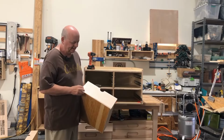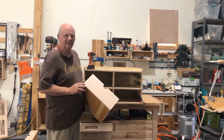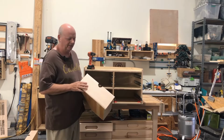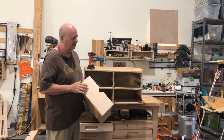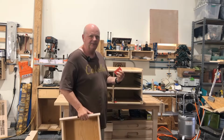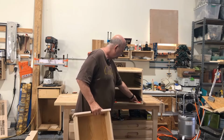So I completed sanding all the drawers, applying a slight chamfer just to soften all the edges, and put 3 coats of poly. So now it's time to install the drawers. Has a spacer. I'm using these handy shims. Each is 1/16, so I'm just using 2 everywhere.